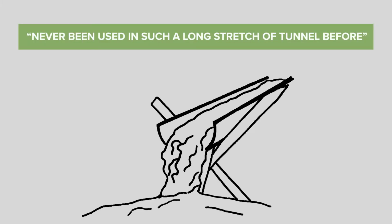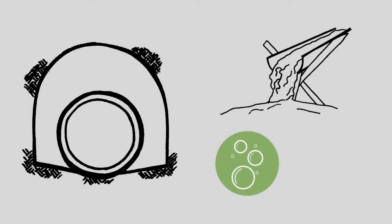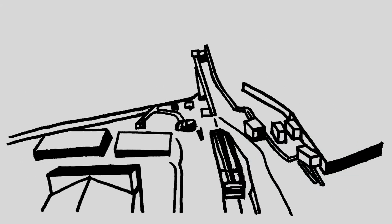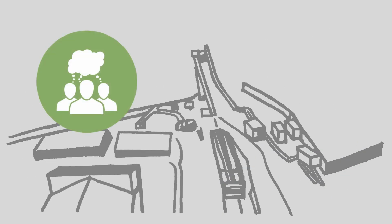We were inclined to attempt the grouting operation in spite of the length due to the limited access points to the tunnel. As we tried to push the grout through the tunnel, air bubbles that make up a large volume of the grout were popping and the volume of the grout was decreasing. Unfortunately, this deterred the grout being placed as intended, so we paused construction, took a step back, and reevaluated.